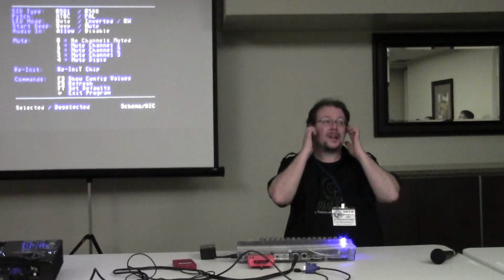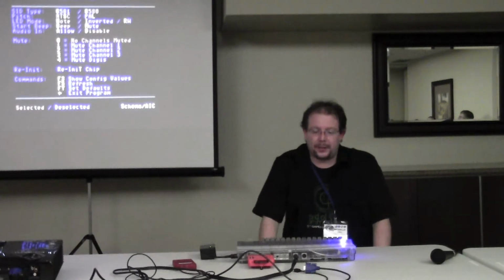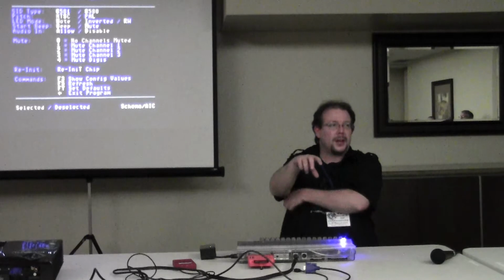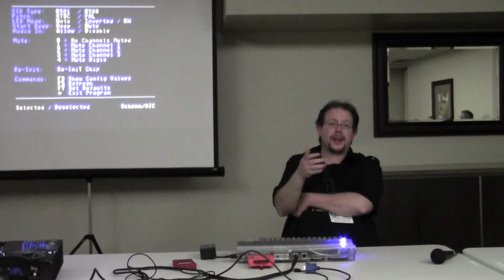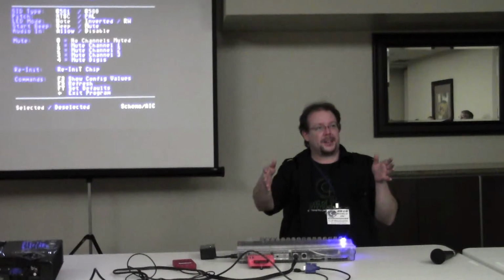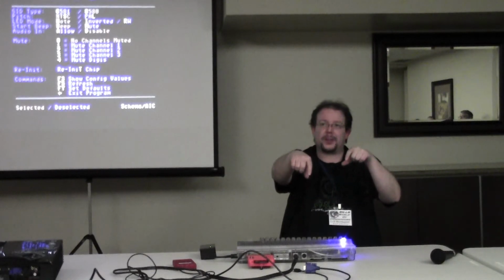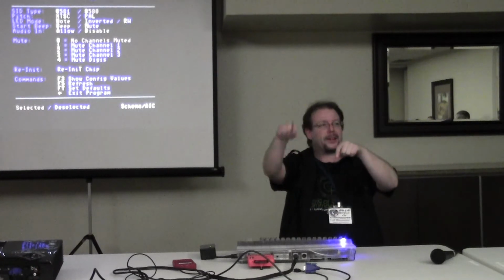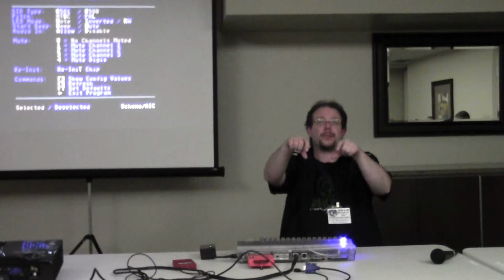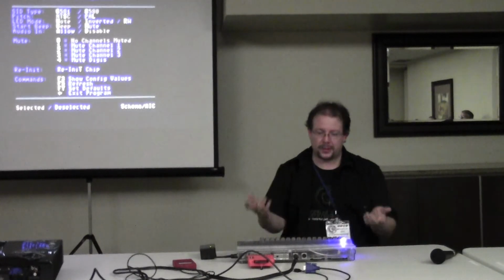Yes, Paul. You double them up into the stereo set? You can. A lot of people have asked for having stereo capabilities in the one chip, but apparently emulating one SID uses like 97% of the CPU. So you can definitely take two SwinSID Ultimates, put them in one of these SID FX boards and assign them to different memory addresses, and then you have your left and right. But it is twice the cost.